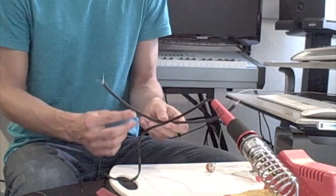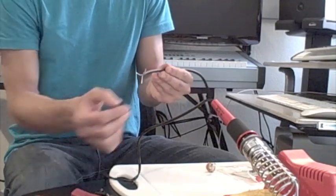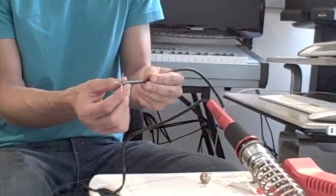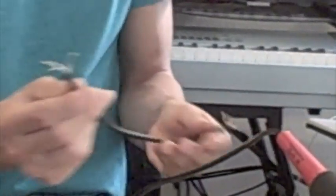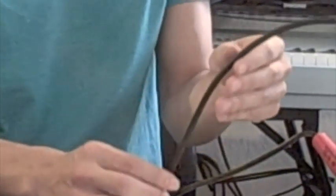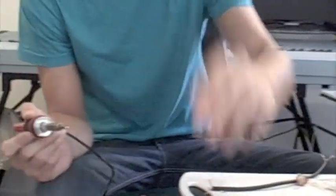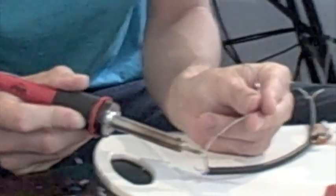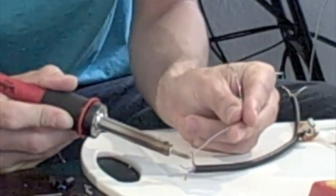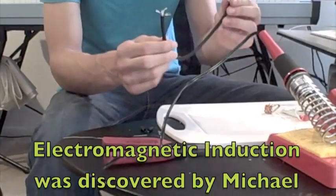The first step is we have taken the cable and sliced a little bit off of each end with the wire strippers and separated out the three sides: the hot, the cold, and the ground. You can see the piece that I have taken off right here. I have already put the solder on the tip of one side and now I am going to put the solder on the tips of this side. Now our cable has solder on the ends.